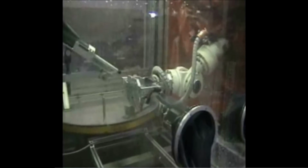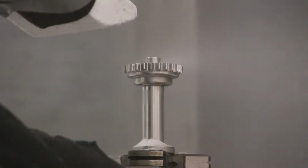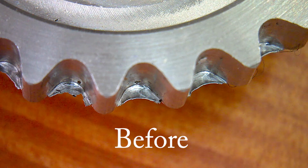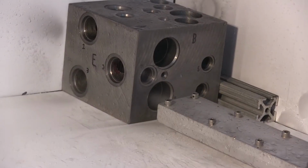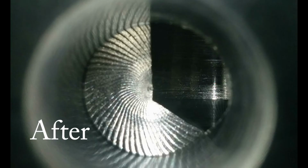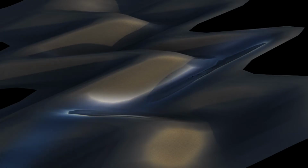Ice blasting is a great way of removing burrs during the manufacturing process. Ice will deform on impact and squeeze its way through small holes, tight slots, and channels, knocking off burrs as it goes. As a result, it can be used to clean off tiny burrs from small or complex parts. At the same time, ice blasting removes greases and cutting fluids left over from machining.